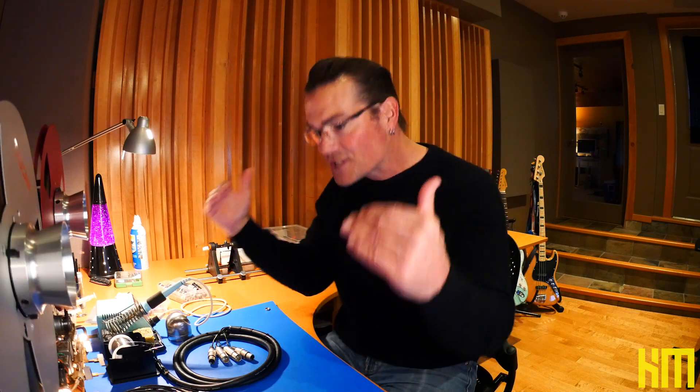Just like a lot of vintage electronics, this tape machine has unbalanced inputs and outputs sitting on phono jacks. So for today's session, I'm going to share exactly how I like to deal with these unbalanced signals in my own studio. Over the years, I've put a lot of project studios together, both permanent and temporary installations. And one common issue with almost every one of those studios was the noise floor was substantially higher than I was used to working in a professional studio.